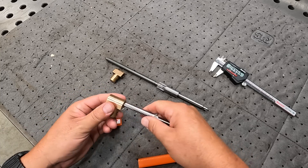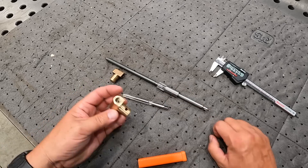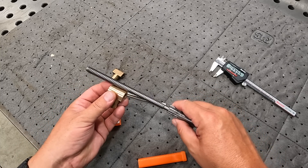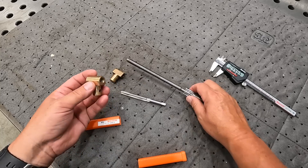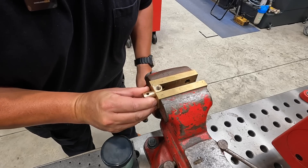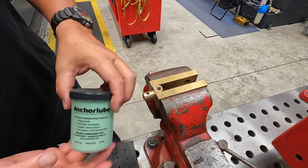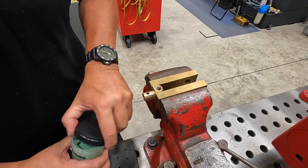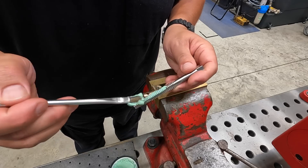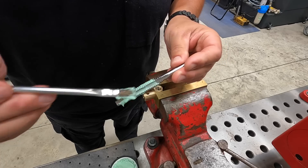It's already starting to get tight a little bit onto that tap. I just hope this is the easiest solution to take care of it. We'll set this up in a vice, get a tap wrench, and run this tap down through that nut and see if it actually screws onto the lead screw. We'll clamp it right here in the vice using our brass soft jaws. We're going to use some Anchor Lube on the tap — it works really well for tapping, especially hand tapping and power tapping in the mill.